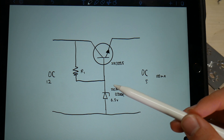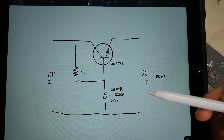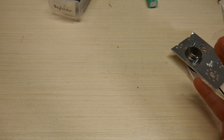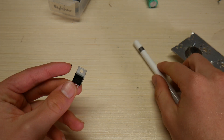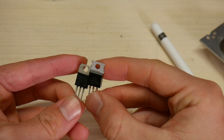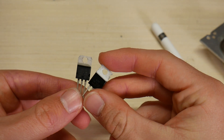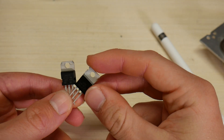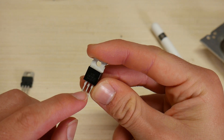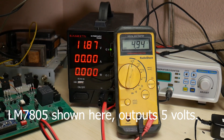One problem with this circuit is that it is inherently unstable — it just doesn't have enough components, and the output voltage will fluctuate. To make this more stable, you can add an operational amplifier and some other circuit elements. That is actually done for us in professionally made packages of regulators. I have here an LM7812 regulator and an LM317 regulator. These are both TO-220 packages and they contain all the circuit elements to make the regulator work. For the LM7812, you just ground one side, put any voltage in, and 12 volts comes out the other.